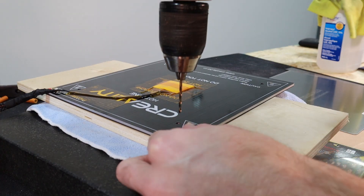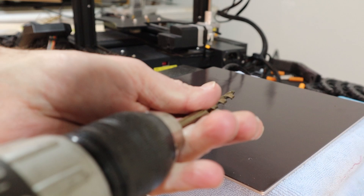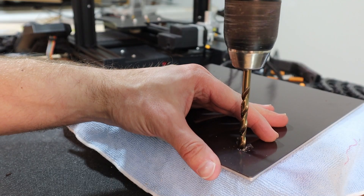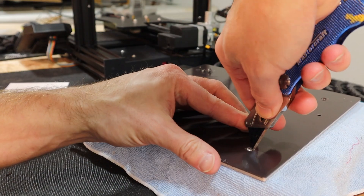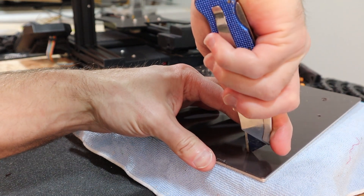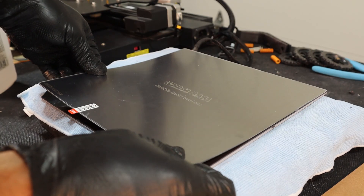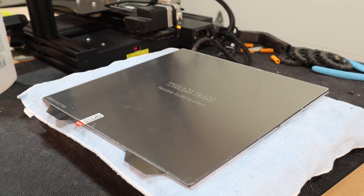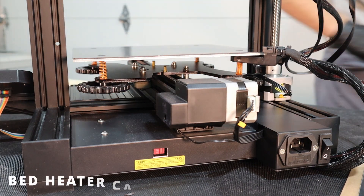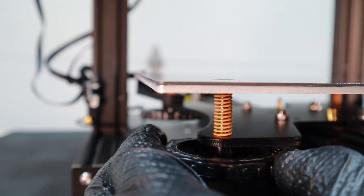This is starting to look really good but now we have some holes to deal with. I'm gonna flip it over, drill those small holes to mark the centers first and then come at it from the top with a larger drill bit to clear out most of the hole. The large bit doesn't really cut this material very well, so I'm going to have to go back with a knife and carefully remove the leftover around each hole. What's important is we don't leave any raised bits that would prevent the steel plate from meeting the magnet properly. That finished off pretty nicely. Now it's just a matter of reinstalling the bed — expect to have to do it again because the bed heater cable support bracket needs to have the spring above it, not below it.